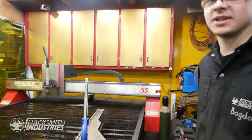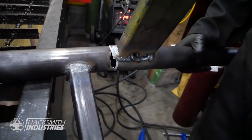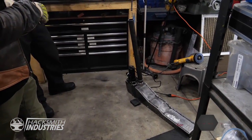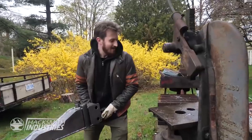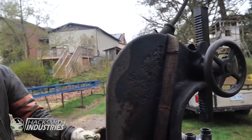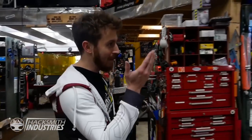So after welding the bushing tubes into place, we attempted to remove the actual tube used to prevent the thing from shrinking or warping using a hydraulic press. It did get out about an inch, but the actual tube sheared in half. So we're going to need a different method. I haven't had any luck getting the pipe out of the welded pipe. We need an arbor press — we don't have an arbor press. But our neighbor just got an antique massive forging old school arbor press, and he's in the process of fixing it. So we're going to go try and use it. It's got to be at least 80 years old and has to weigh over a thousand pounds — practically one piece of steel. It's stuck in there good. It would have been so perfect if it worked. We need a real hydraulic press to get that pipe out of the gripper. So we went and bought a hydraulic press.